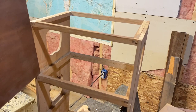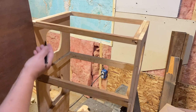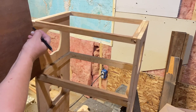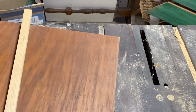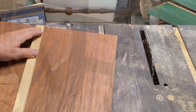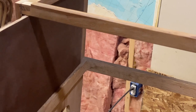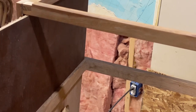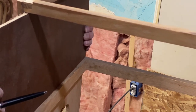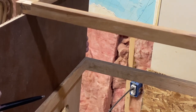Now I'm going to start the process of cutting some pieces to go in these slats to cover up the gaps on the side. I'm going to need to make four of these pieces, so I'm just putting this board up there and measuring how tall I want it to be. I'm going to cut it down on the table saw again, then slide it in where it needs to go — it's nice and tight. Now I need to measure how wide I want it to be, so I just tuck it in there, get it where I want it, and make a mark with my pen.